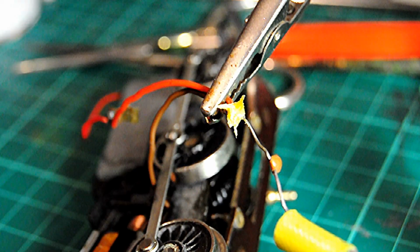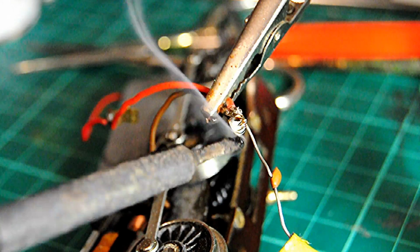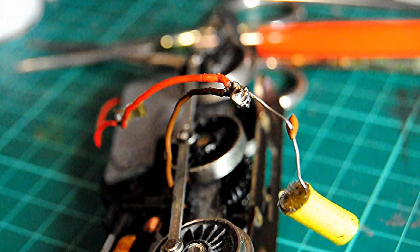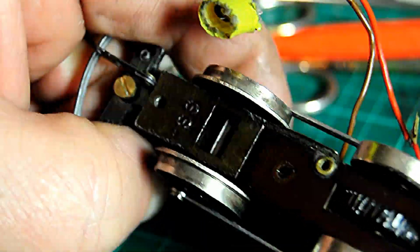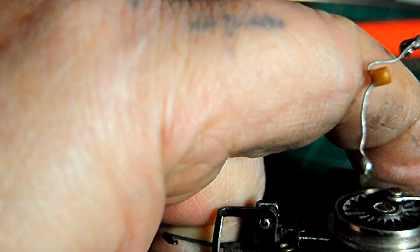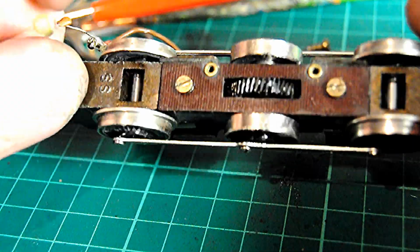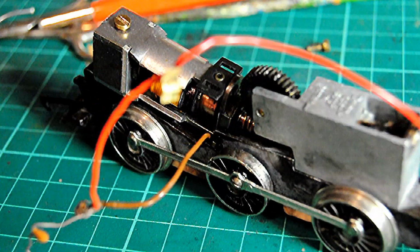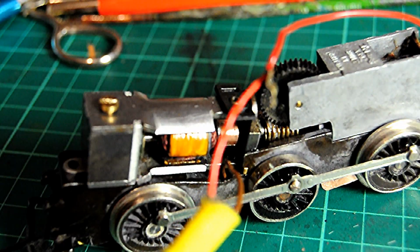And here I think I'm trying a run. Oh no, sorry, I'm soldering. It's not my power clips, it's my helping hands. I actually altered the wiring. Later on I put a new piece of wiring in from the base plate and up to the motor, and I scrapped the diode at the back, cut it off. I just went direct to motor and smoke unit.